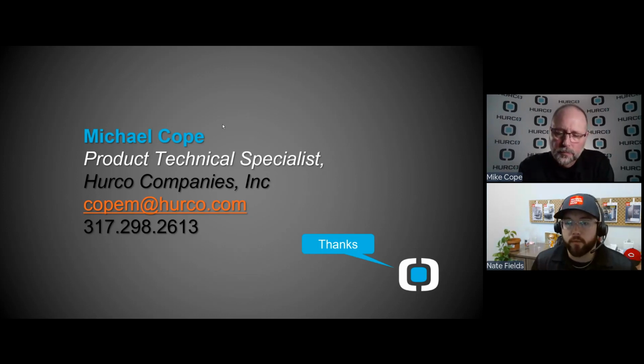For sure. Next up, so if I want to start my own shop, could I start directly with 5-axis? Yes. Quite honestly, what we see is anyone who's starting a new machine shop, and they're going to be limited in time, limited in resources. They're not going to have a lot of people to draw from or a lot of spindles. 5-axis machines with some type of automation seems to make the most sense, because you're going to be able to gain more hours in the day, and you're going to incur that right off the get-go when you're starting anyway. So I think the return on investment is pretty quick there.